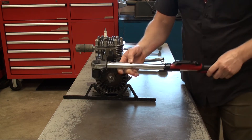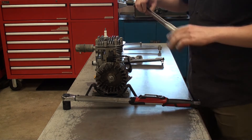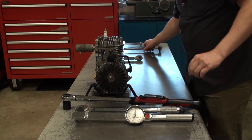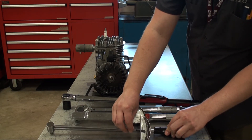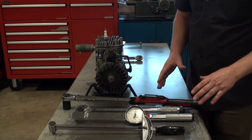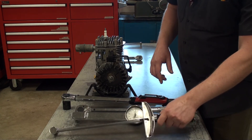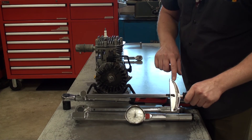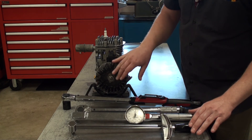That's how you use all the different types of torque wrenches in the shop. While they read a little differently — some have digital displays, some have displays written on the tool, some have gauges, and others have a side measurement reading with arms that move — they're all doing the same thing. Just different styles from different manufacturers. Don't be scared if it looks different; just figure out how to read it. Make sure you have it set to the correct units: if you're measuring in foot-pounds, make sure you're not in inch-pounds, because 50 inch-pounds would be way too loose compared to 50 foot-pounds.